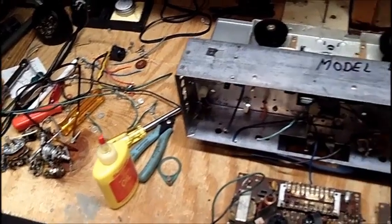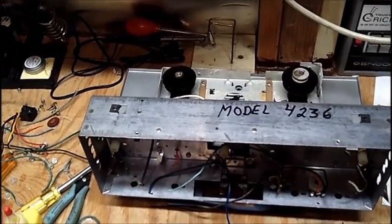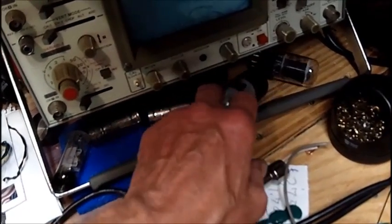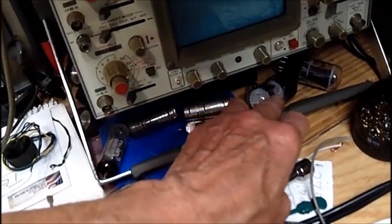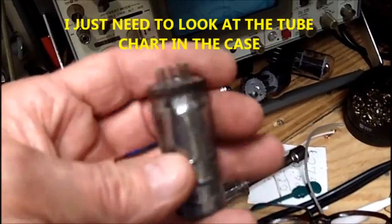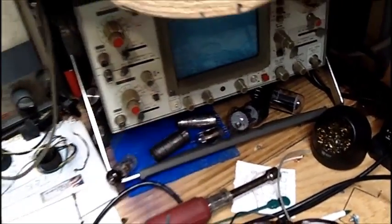And I could have just taken it and throw it at a flea market or something and let somebody else worry about it, but I can get use out of some of these parts and these tubes over here. There's 6 tubes, not counting the EM85, I think it is, or 86. I got 1, 2, 3, 6 tubes. 6AV6, 6EM7, and I don't know what's in here. I don't have the schematic. I can get this out. I guess I have to push it out without breaking it. I don't know what this tube is in the shield here, but it's 9-pin. Could be a 12AX7 possibility.